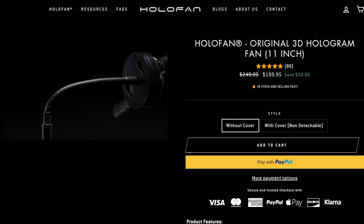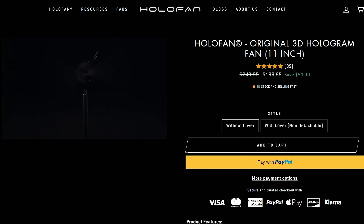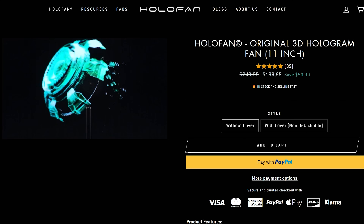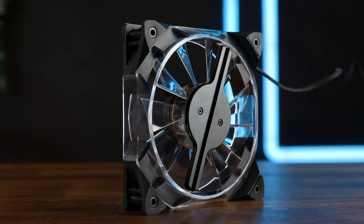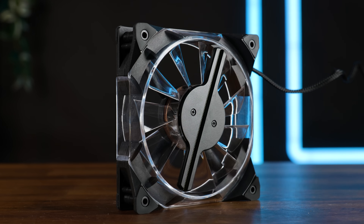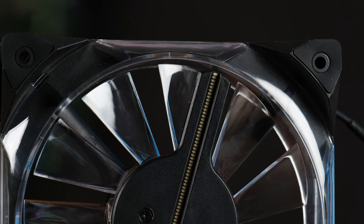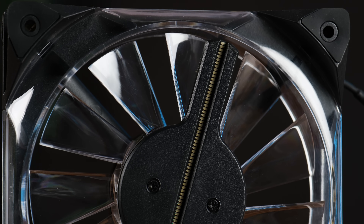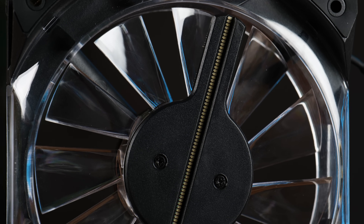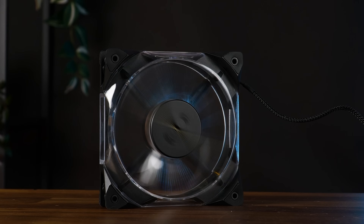The tech behind this isn't necessarily new. Maybe you've been aware of these kind of holographic types of monitors — they are basically just spinning blades with a bunch of LEDs attached to them which are spinning really, really fast, and if you light them up in the right color at the right time, boom, holograph. On here it's basically the same thing. The fan consists of 11 blades, and on top sits this giant black piece. This thing spins with the rest of the fan and in the middle you can see the 96 individual LEDs. The fan spins, the circle spins with it, the LEDs light up for a fraction of a second at the right time — boom, you've got an image.